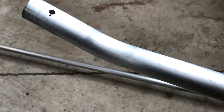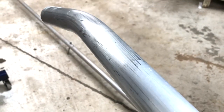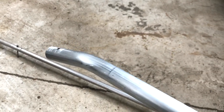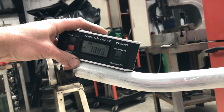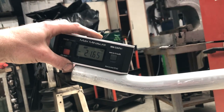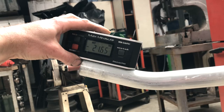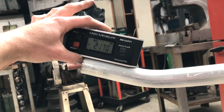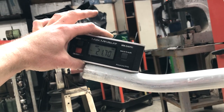There we go — no puckering at all on the inside. There is some flattening on the outside, but being thin-walled aluminium that's about the best this machine can do on such thin material. Tubing always springs back, but by different amounts according to the thickness and diameter of the tube. It's best to do a test with the same gauge material, work out the spring back, and then you'll always get what you want. On this occasion it's just over 3 degrees of spring.